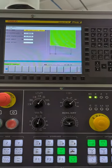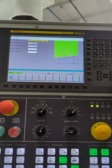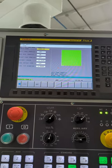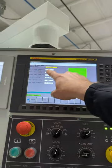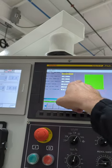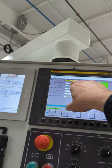There's a left taper, and I end up using this profile one. There's a right taper one. I didn't use those because I wanted more control than that. So here's what I did. I did a profile, and I'm using just the outer diameter profile. I'm not going to profile anything on the left face or the right face, so those are turned off.